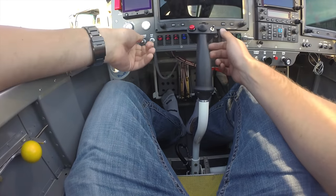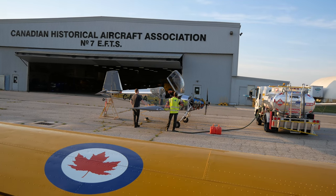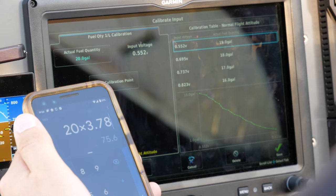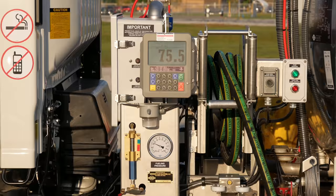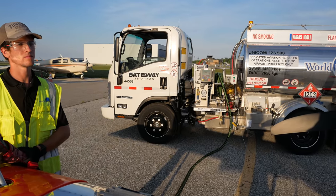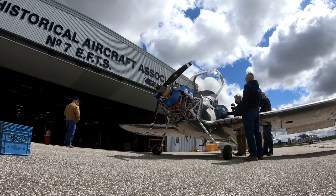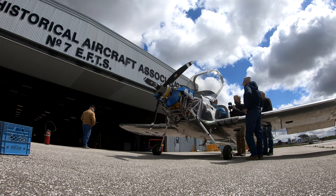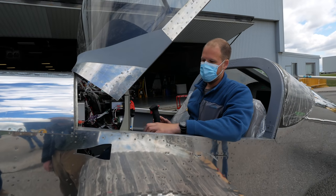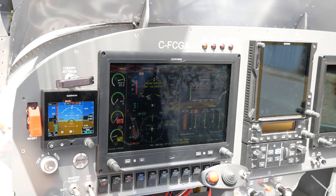Master on - got to go into config mode. We're aiming to be accurate down to the gallon with the fuel senders. This is going to be some precision pumping - we're working with a Canadian fuel truck that pumps in liters. And that catches us back up to the somewhat anticlimactic first start. This is a non-event - both ignition breakers are pulled, there's no ignition, mixture's cut off, the mags are off. I'm just going to crank until we see oil pressure on the instrumentation, and the bottom plugs are out.